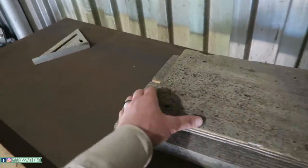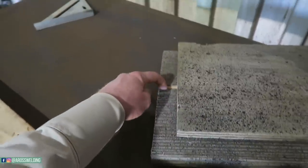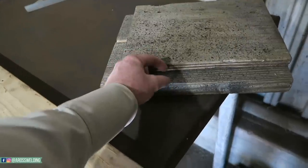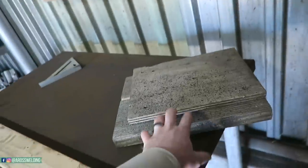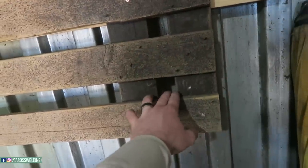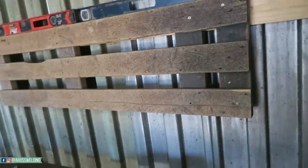And then a lot of people put this piece of plywood on here, because sometimes these get to where they crack, as you can see here. So they put that on there for extra support. They left this plywood down a 2x4's width to go right in here. And that's why you're actually gonna want a 2x4 at least, whenever you go to space these out. That way you have the proper width right here in between these 2x4's.